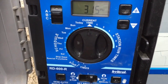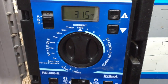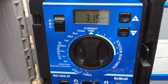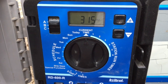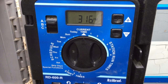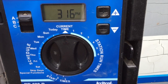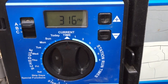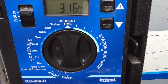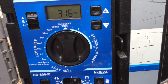On the dial, to the right we have stations one through six — this is a six-station rain dial. Straight up is current time. To the left is today, so when you turn the dial it should show the day of the week on the clock; plus or minus will change that. You can see Sunday through Saturday, and at the very bottom is skip days. If you want to choose specific days, skip days must be turned off.